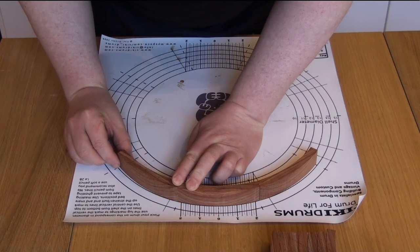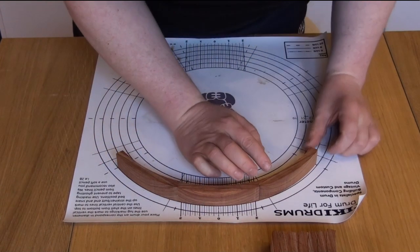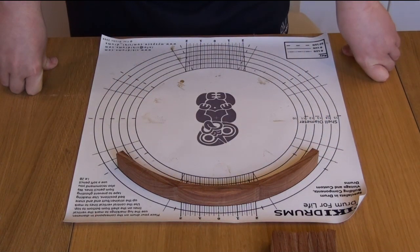What we need to do now is sand these pieces so that the angle isn't quite as sharp as it is at the moment — it's maybe just over 18 degrees, and we need to sand it to exactly 18 degrees. That is quite a tricky thing to do, to set up the sander to get it to sand pieces to the angle you want.